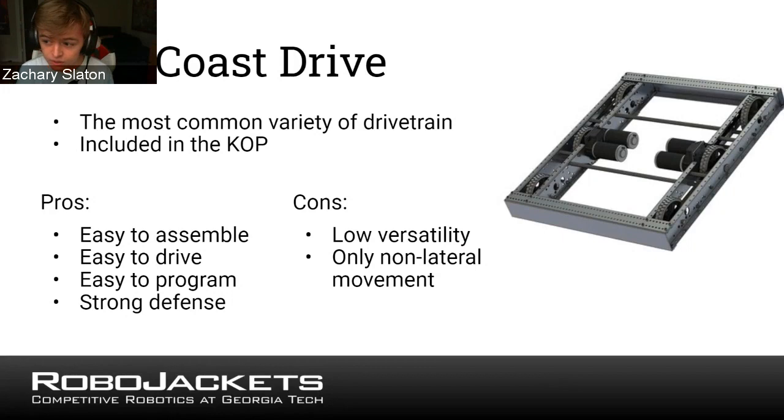So the center wheel is slightly below the 2 side wheels, which causes some rocking, which has some interesting properties on the drive. When you're driving in one direction, because it tilts slightly, only 4 wheels are ever in contact with the ground. And when you go the other direction, obviously it switches slightly. So adjusting the amount of drop center can change how well your robot drives in certain terrains. If there's ever an obstacle or a barrier on the field that you need to drive over, increasing your drop center would raise the gap between the wheels at the front of the robot, allowing you to drive over it easier, but it would also make your robot more unstable because you'd be rocking more.